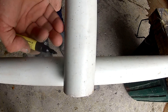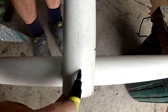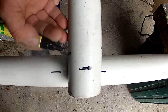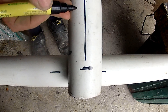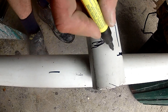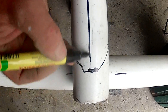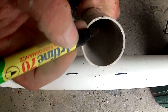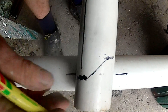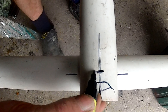What I do when marking the pipe is mark it in line with the outside edge of the pipe, then mark where this pipe on top lines up with the middle of that pipe. That gives me the two points I need. I also tend to put a line across the top and mark the top. Then I can turn the pipe on its side and map out where the half circles need to go - I've got my furthest point and my shortest point. Once I've got the top marked and cut, I transfer that mark up to the end of the pipe and go straight across. That gives me the bottom edge, and now I can do that exercise all over again - I've got my side marks and I can pick up the point for the middle of the pipe.